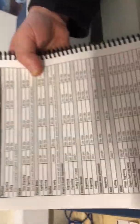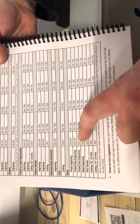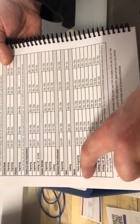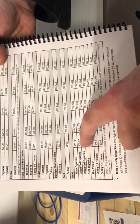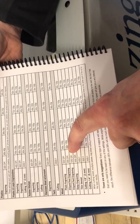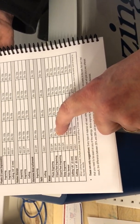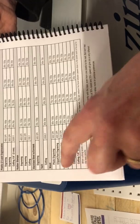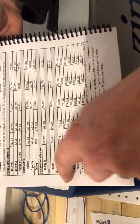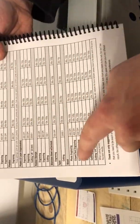If we look at the plywood that I've just done, there's some settings there for photo engraving, for clip art text settings. I use this setting here, so 400 dots per inch, okay, 50% speed and 100% power for doing the engraving. And those will work on any plywood, irrespective of the thickness, because we're just processing on the surface.